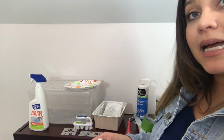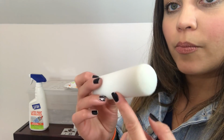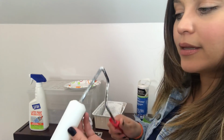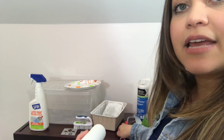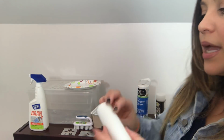And this actually prevents a lot of bleed over and getting in and messing up the actual design. Now, for applying my paint, I actually like to use a 4-inch foam roller just like this. Just make sure you have the right little handle for it. And I think this is what gives the best and even coverage for your application on the wall. It does a really good job.